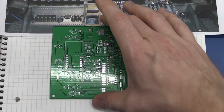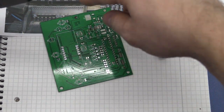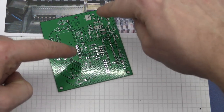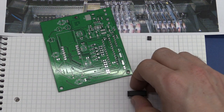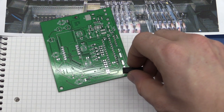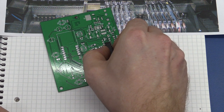Then it doesn't really matter if we put it in like this. We could basically put it down anywhere, just let the software compute it, and then we can transform our machine coordinates to our board coordinates. So we always just pick up the component, we let the machine do the calculation, so if this was 90 degrees before, it will now have a new value and a new position, so the machine will automatically put it correctly.